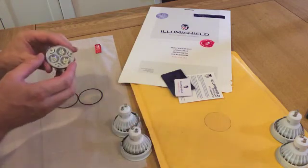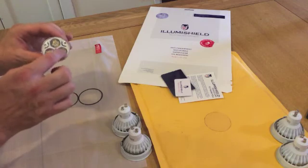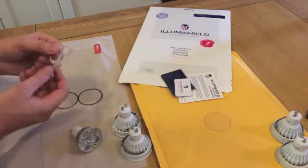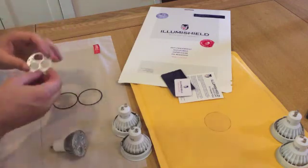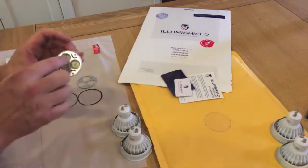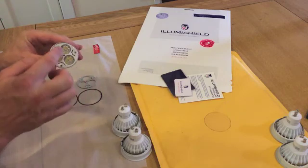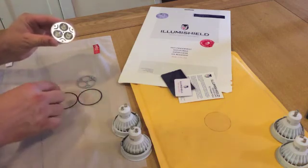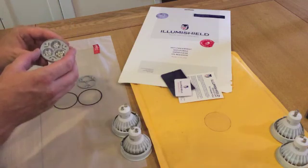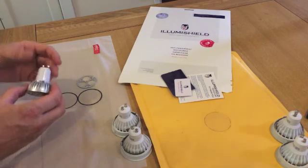The other type is this GU10 fitting where I can't easily fit anything underneath — they're going to have to stick to the glass. I've removed a section of trim to use as a template, drawing each section off and then cutting out the small round circles. I clean each of these with a bit of isopropyl alcohol to make sure there's no grease — bearing in mind these are from the kitchen, so they will pick up grease. Then I stick each of the little bits of blue light filter on — they're completely flat so they'll stick really well, just like sticking it to a computer screen.